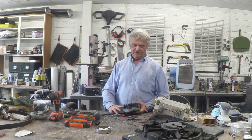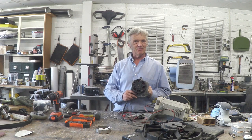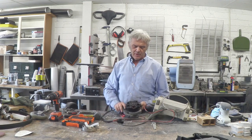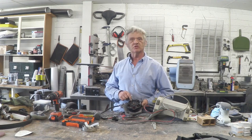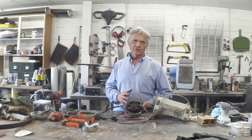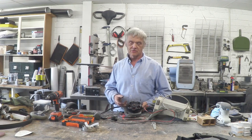My friends at Canterbury Automotive brought me this thing. It is in fact a fan motor, but it's a fan motor from a BMW. Mostly fan motors look like this - they're 12 volt brush DC motors and they're not bad at all for sticking in a wind generator. When they brought this it was immediately obvious this was a brushless DC motor and it's a fairly chunky thing. The electronics are gone but we're not interested in electronics - we're interested in the coils and the magnet arrangement.